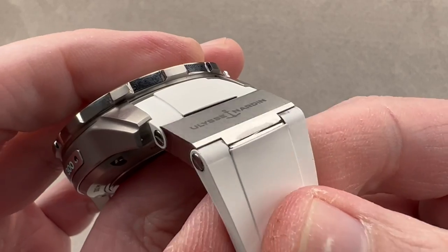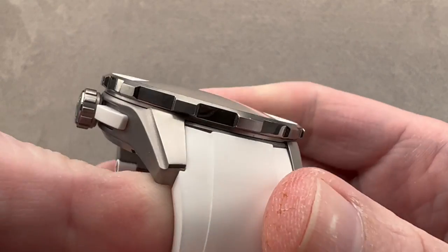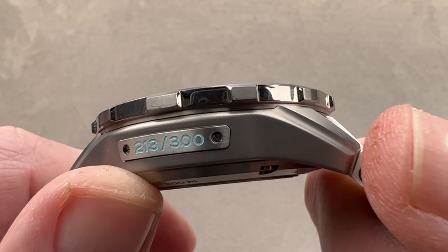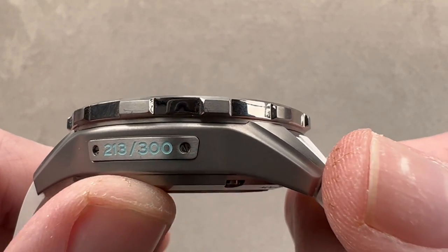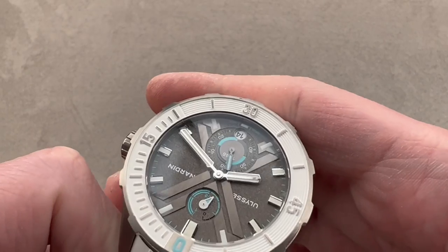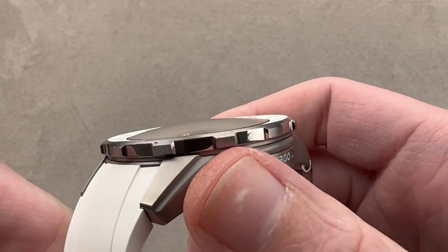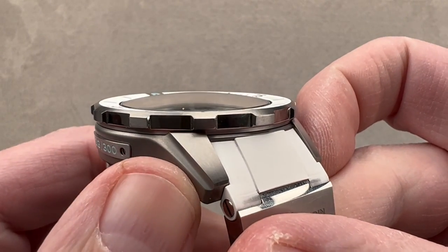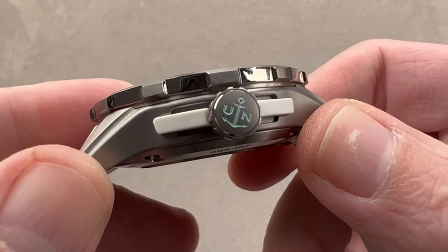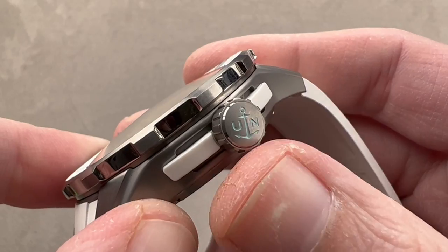The grade five titanium articulated hinge features a combination of polish and satination, and the case and bezel are grade five titanium — more scratch resistant than steel, hypoallergenic, and lighter than steel. Individual numbering is a nod to UN's history as a maker of marine chronometers, which were almost always numbered using flank-mounted number plates held in place by screws. The bezel features a combination of satin finish and bright polish, the lug hoods are satin finished, and the flanks are media blasted. There are also polymer crown guards that can be replaced if gouged, and a crown that is alternately polished, satinated, media blasted, and then lacquered with a lovely light blue.